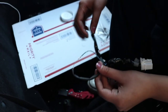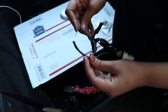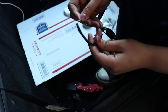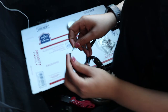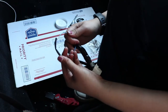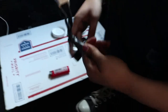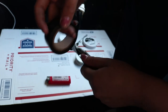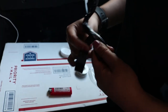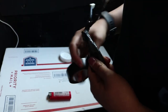She's soldering the other side of the resistor together. Once that's done, you move the heat shrink tubing over the solder joint and shrink it down — and that's it. It's the same process on the other side: cut the yellow plug and wire in the resistor. We folded the resistor back against the existing wire, and now she's wrapping it with electrical tape. Done.